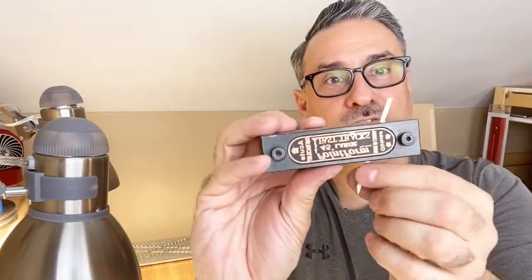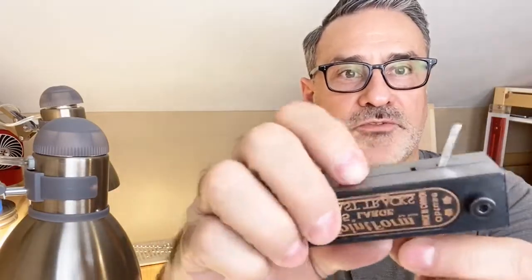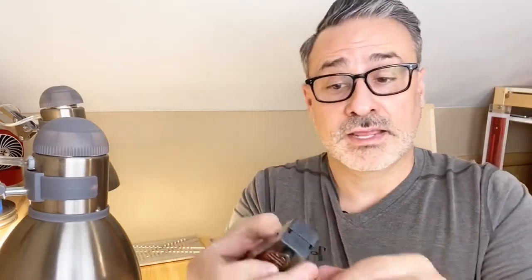When using the point form tool, there's a little bit of play in it. What you want to do is hold it, push it on one end, then tighten it down, and do your filing from there so your angle is always consistent. Even with a 45 degree angle, when I needed to take shavings off, I could just finger-tighten it and hold it with my finger so there's pressure against it, then do the filing and make quick adjustments without getting out the wrench every time.